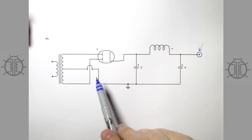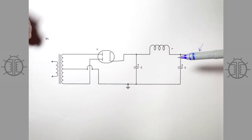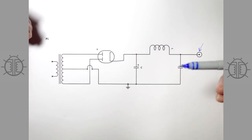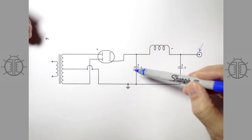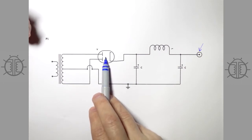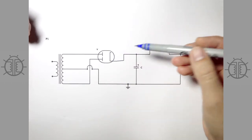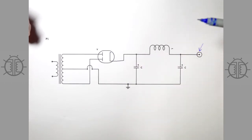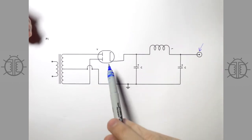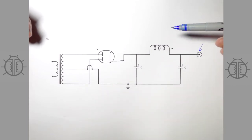This works very well; there's nothing wrong with it per se, though things could be improved. At the time, this was about as good as you could get. Some major problems with this design: tube rectifiers go bad pretty regularly, even more so than regular tubes. Whereas tubes get weak when the cathode stops emitting properly, tube rectifiers rarely get to that point — they usually fail more spectacularly than that.